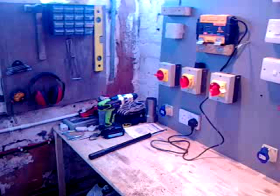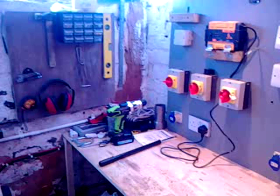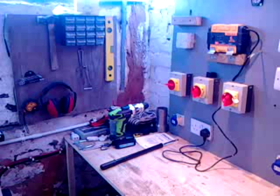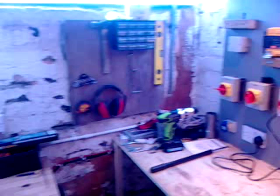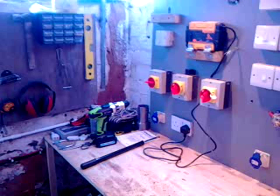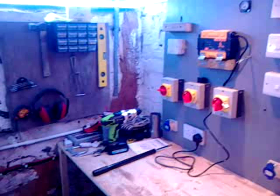That is a pure sine wave, but I think I might just get myself a modified sine wave inverter just to be going on. I can get a 2000-watt modified and it'll run everything pretty much the same — besides computers or fluorescent lights. It's not really good for that equipment, but I've always got my generator anyway if I need some clean electricity, so I'm not really bothered.